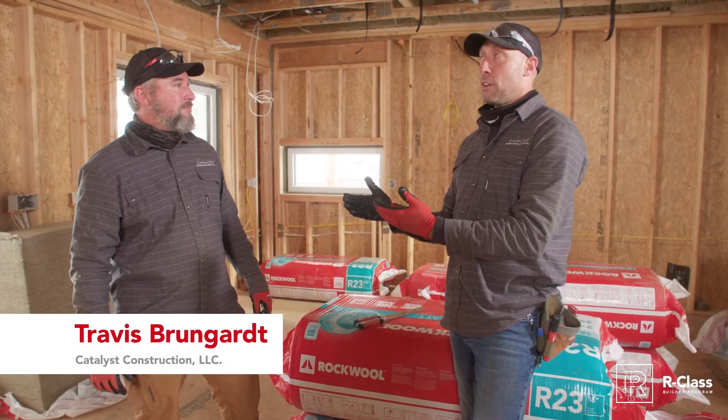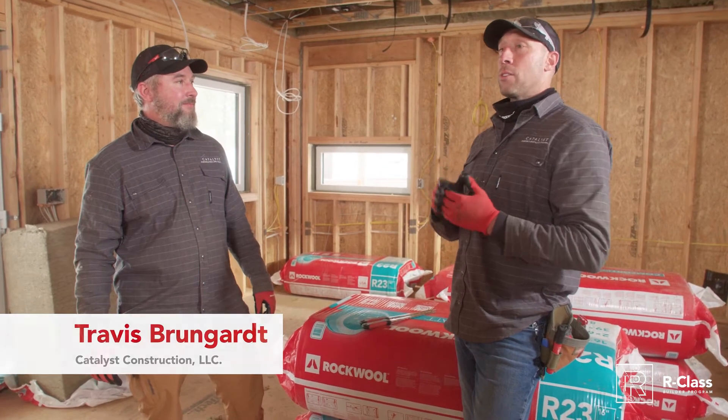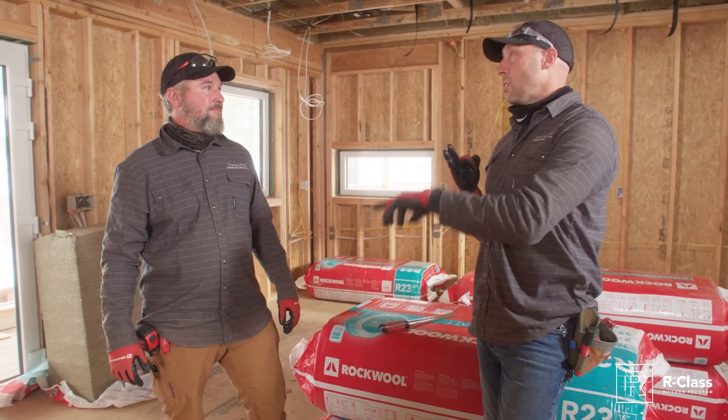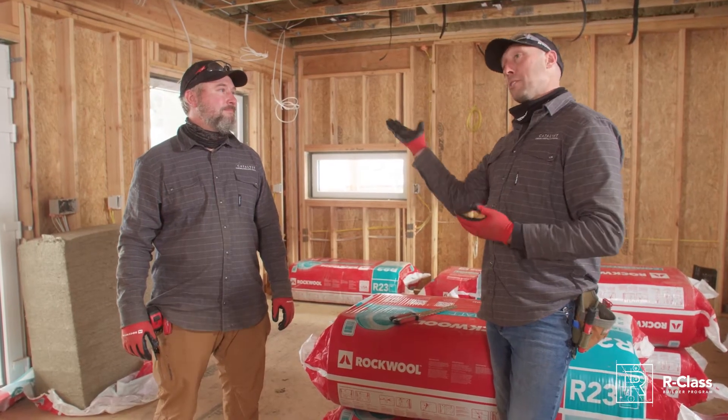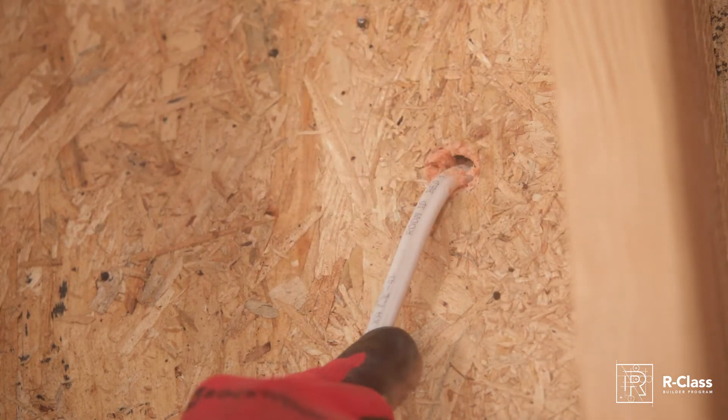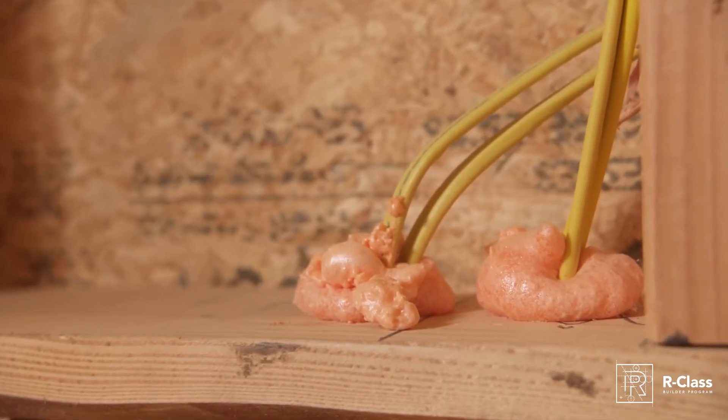The main focus is air — we've already solved for water at the exterior and for air at the exterior as well, but this is our last line of defense. Mechanicals installed after the fact — line sets, dryer vents, exhaust fan penetrations — don't always lay out the way you want. If they happen after you've done your exterior insulation, this is your last chance to address that air leak. We do blower door directed air sealing: we depressurize the house, go around with a smoke puffer, and see where the air leaks are before insulating. With that procedure already complete, we know where the air was coming in — we've taped it, we've sealed it — and now we're ready to insulate around our penetrations, especially through the top plate and bottom plate.